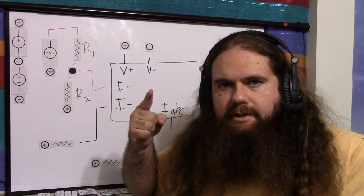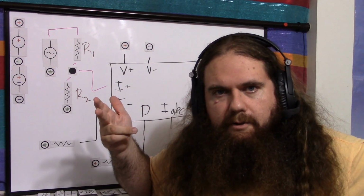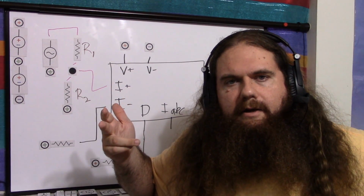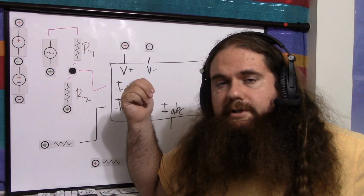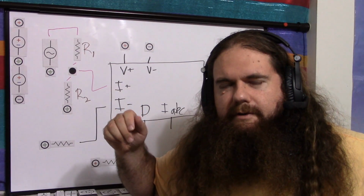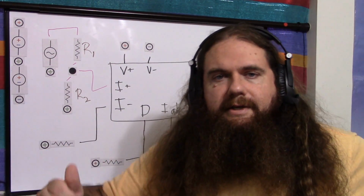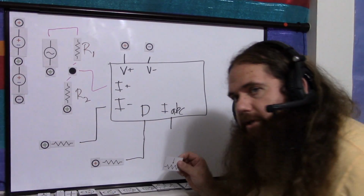You can use a potentiometer, a little knob as a voltage divider. You can use voltage output of some sort of microcontroller connected to a digital to analog converter. Any way you can get a variable voltage. This is called a voltage controlled amplifier. In this configuration, you just put a voltage across a resistor that gives you a current into the gain. Nice and easy.